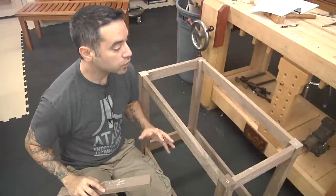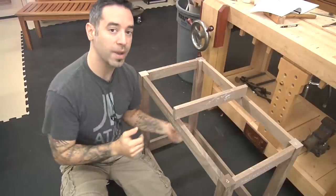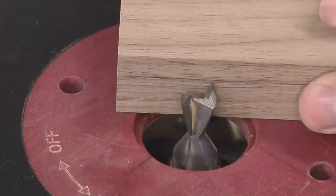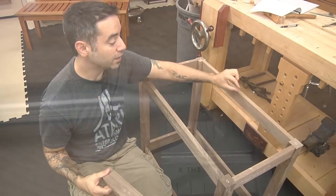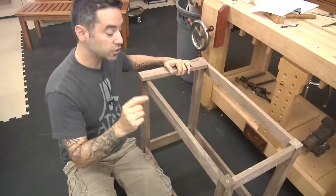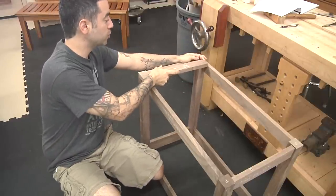With the basic framework done, we can start to focus in on some of those cool details that make this piece unique. One of those is the center divider that's going to divide the whole thing into two compartments. We could attach this to the front and back rails using the dominoes, but I want to do something a little more fun. This is going to be a visible joint, so it might be cool to do a sliding dovetail. All it really takes is a single router bit, and we'll use the router table. I need to cut my center piece to the distance between the front and back rails and then add a total of an inch, since the dovetail will go in a half inch into each piece. Take your measurements from the side where you're closest to your joinery, because here we can have some movement and things can bow out.